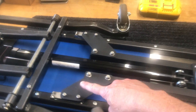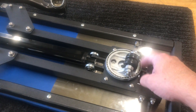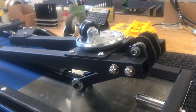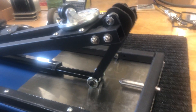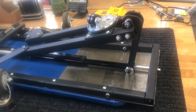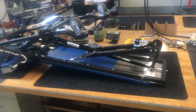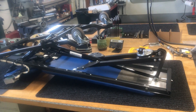Here's how the mechanism works. There's a hinge-ax mechanism coming over to here, and there's another caster that it pushes off on — you'll see how this lever mechanism works. Let's raise it up: that gives its initial lift, and then when it's time to go to the second stage it will hit this pin here and really start lifting. At that point it's got enough leverage to act in a simple mode like that. And there we go — that's the automated Aero Creeper for aircraft maintenance. Tom Matthews at Matthews Engineering.